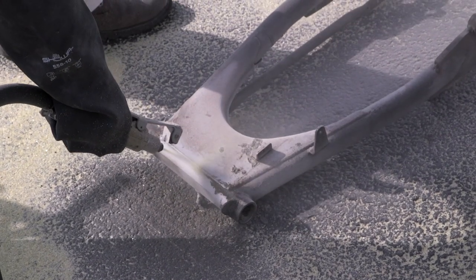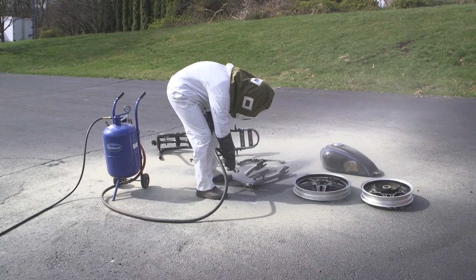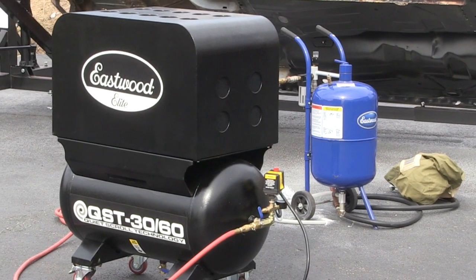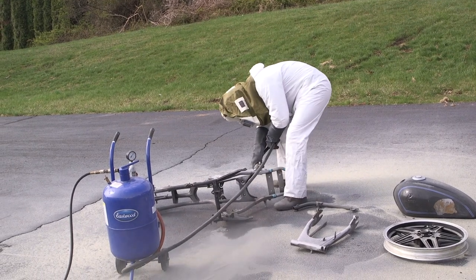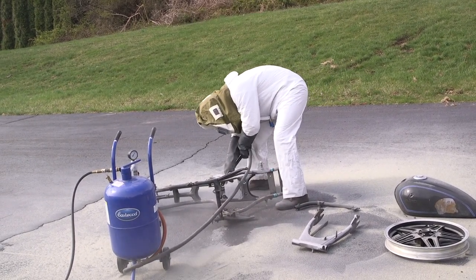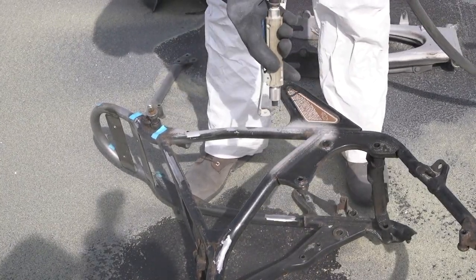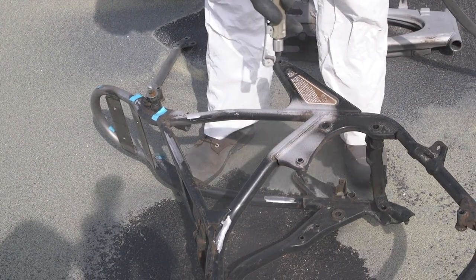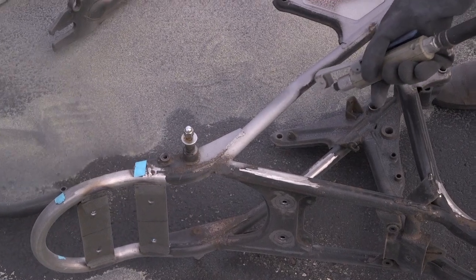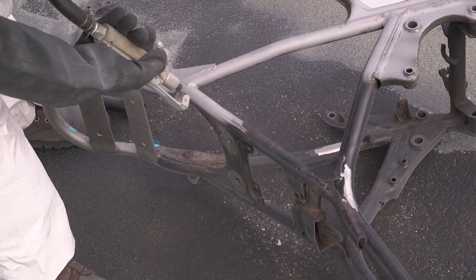Blasting is an incredibly easy process. It's time consuming and it can be messy, and it can be hot or cold, but it's really easy to do. All you need is a compressor — we were using the QST for this because we can pull it out back. You need the blaster itself; today we're using the 100-pound media blaster. You need some media — I always like going with glass beads, but if you want something more abrasive you can go ground glass. We have a ton of options on the website. When you're blasting, you definitely want to be in an area very far away from your neighbor's house, other cars, and other people.